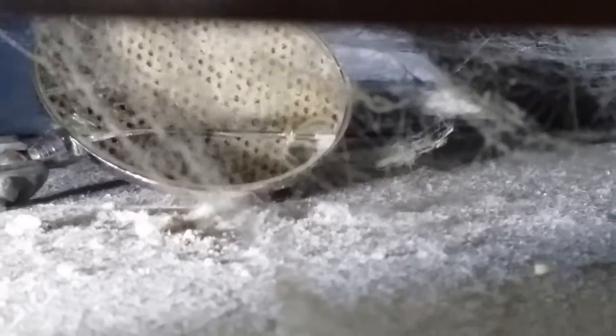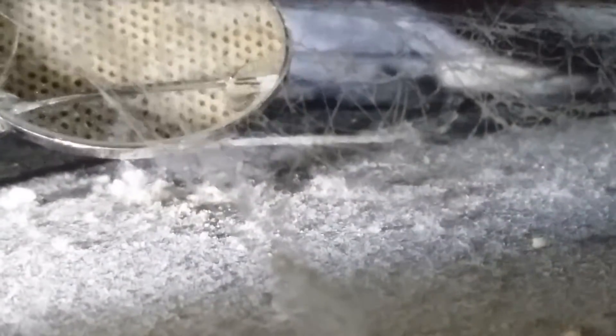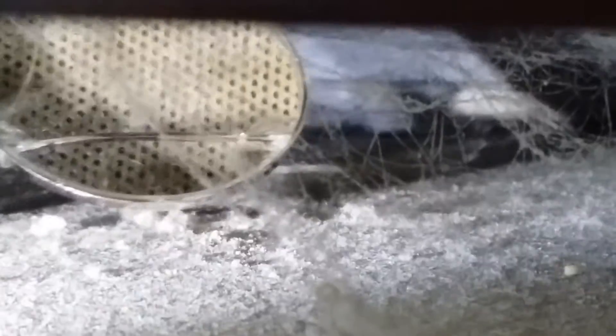Also, if you've had even just a couple inches of water, this particular water heater would have to be replaced because this disc is not replaceable. When it gets wet it kind of tends to collapse in on itself, and it does the same thing just as if it was dirty. There's nothing you can do to fix it.